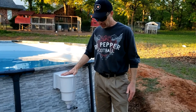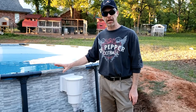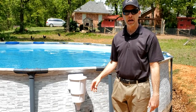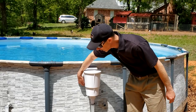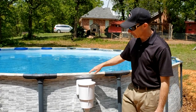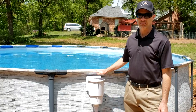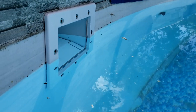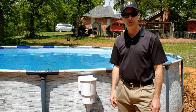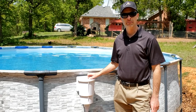All the hard work is done. You can see that it's hooked up — it looks like a regular skimmer. I'm going to fill the pool up the rest of the way and we're going to try this thing out and see if it's working like advertised. It's the next afternoon. Got the pool filled up how I wanted it and this thing's working out great. There are no leaks around here — it's a nice tight dry installation. I did a little experiment: I plugged that other inlet port to the pump and just used this skimmer. I can tell you I'm getting five to ten times the amount of surface water coming into this skimmer than when I had that other port open, because now all the water is coming through the skimmer into the filter. It's working out great. Hopefully this has been helpful — it's really easy to do. Like and subscribe. Good luck, thanks for watching.